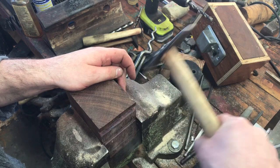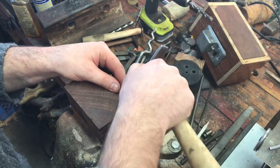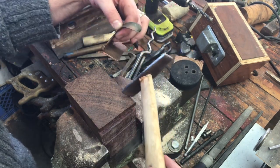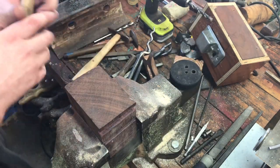If you try to sell it after this it will probably be half-priced because of all the dents — that was a bad joke. But what I'm doing is trying to create a groove for forming to occur. So when I take my metal and hit it, form it, I'll create this impression on the opposite side. That's kind of what I'm looking to do.